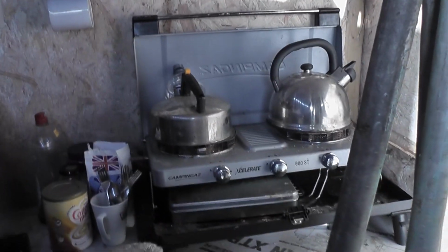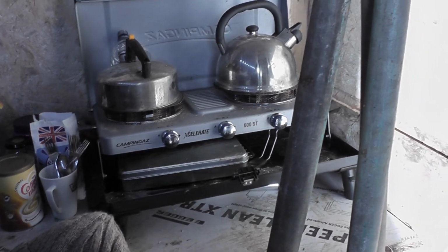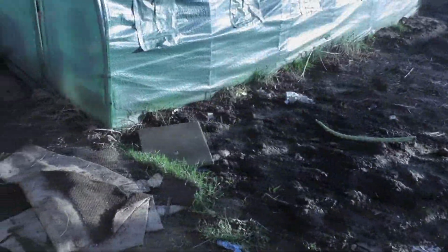So what I'm going to do is have water fed from the rainwater coming off the shed and the greenhouse, or well, the greenhouse is actually going, but coming off the shed and the chicken coop, that's all going to collect into an IBC. In line with the IBC, I'm going to have a tap, and that's going to come in somewhere around here. It might actually just come in here, but on there will be a pump which will come up to the tap. Off the tap, I'm hoping to put a splitter on it, and underneath here we'll have some cables, some piping that'll go out and into the polytunnel, and hopefully water everything in the polytunnel. Like I said, we'll wait and see what happens.